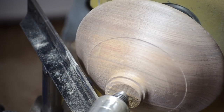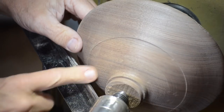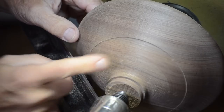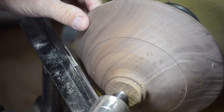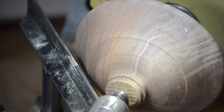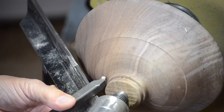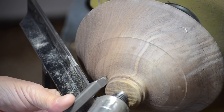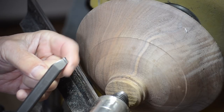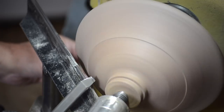I had to stop and work with a student yesterday, so I didn't get this finished. I did do a little shortcut — a bevel rubbing cut — to show how much cleaner it is. I also dropped the tool and got a little dent there. To do a bevel rubbing cut, I want to tilt it sideways so the cutter is cutting at about 45 degrees, and I'm actually rubbing — or gliding — this little bevel down here. Ideally you shouldn't be forcing the tool.